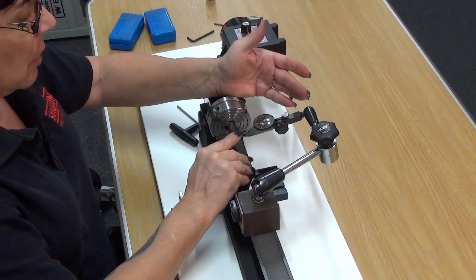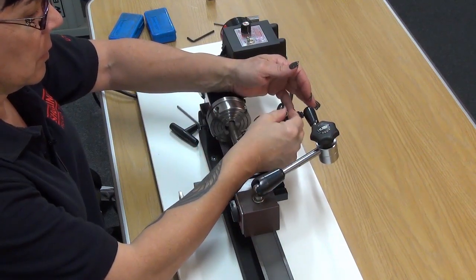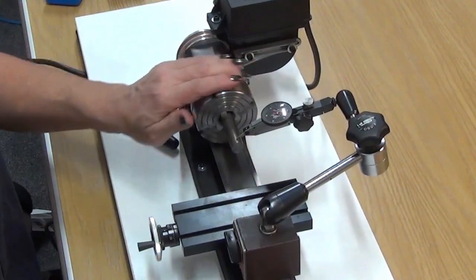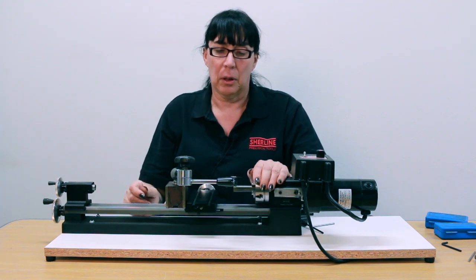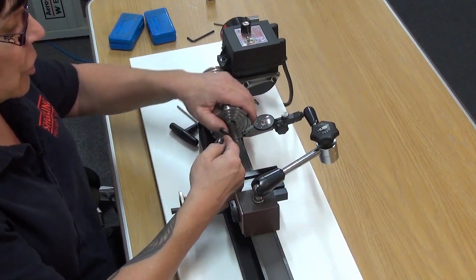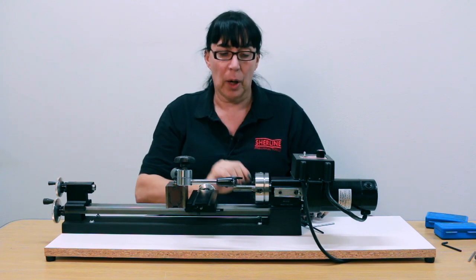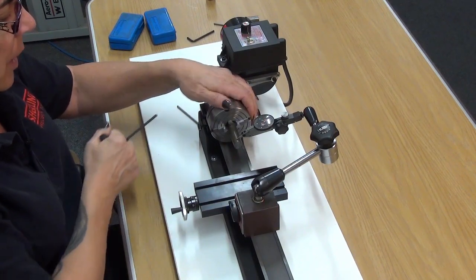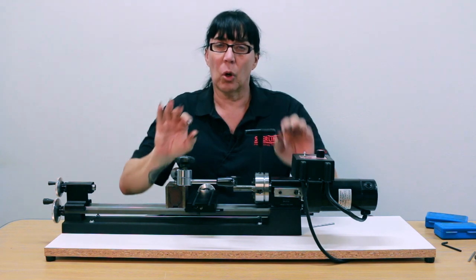I have it just slightly above the workpiece. Use the holding fixture to slowly bring it down until you get a little bit of reading and see where it is. What we start doing now is figure out which jaws are high and which jaws are low. This is the highest jaw right here, so the workpiece has to be brought down. The way we do that is release the opposite jaw just a little bit, back it off, go back to top center, and tighten this one in — that shifts the workpiece towards center.